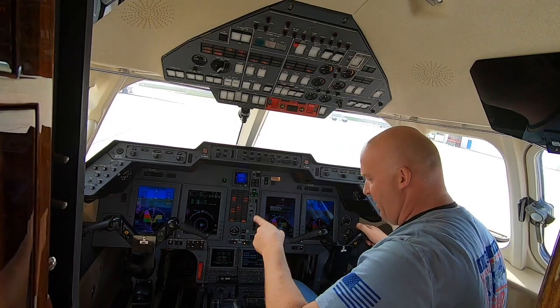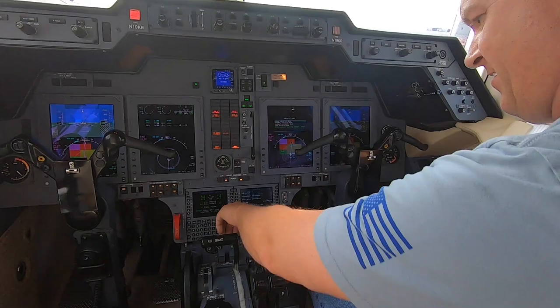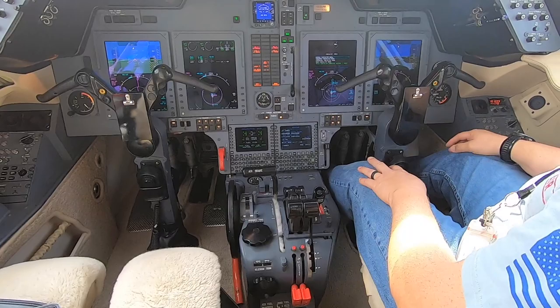Come down here, you got three smoke detectors. This bag firelight right here is not on the rest of the system — if you go annunciators, it doesn't light up. So we got one, you got the lav, you got aft, and these are really sticky. I can tell they never did those checks. Most guys don't.